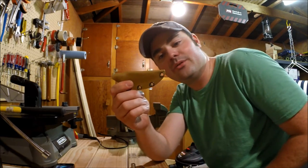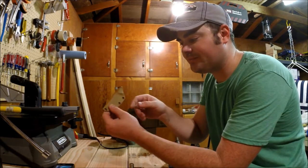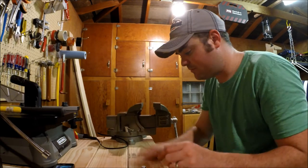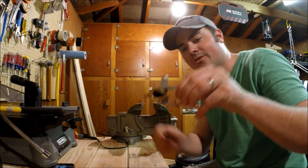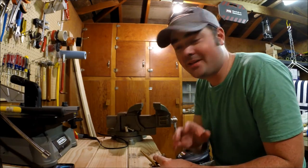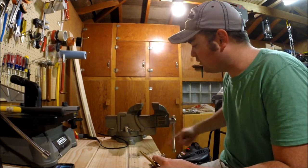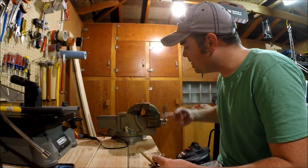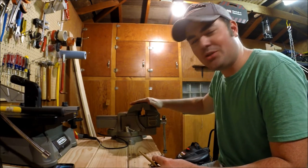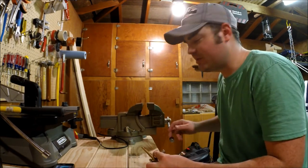So let's pretend I need to put a rivet in right here. You'll pop your rivets in here, then take your journeyman die guide and journeyman die set, and put your project in there like so. You guys have probably guessed what I'm going to do — I'm going to put this in the vise over here. If you're going to put this in your vise, make sure you have a pretty decent vise. You don't want a lot of slop in the jaws, and you want the whole gap to shut at once — not one side closing before the other. Get yourself a decent vise.